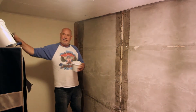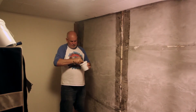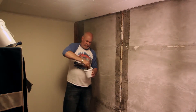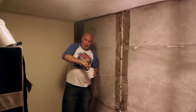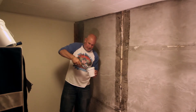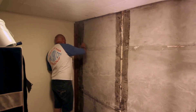This one's white and this one's black, and we're going to mix these together to give it a nice gray color. We take this paste filler and put it into one container like so. We stir these together just like any two-part epoxy. You'll know it's ready when the colors become a consistent gray — almost battleship gray we call it in the industry. Once it's all mixed up, look at the wall closely for any discrepancies, little low spots, and fill those areas in.